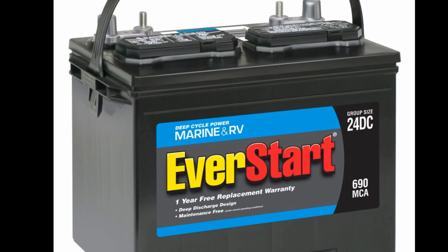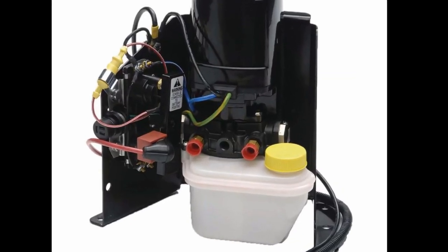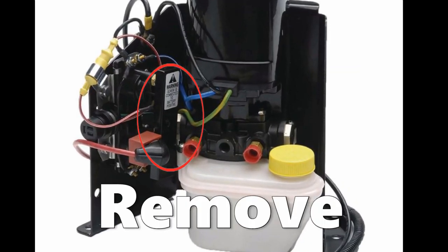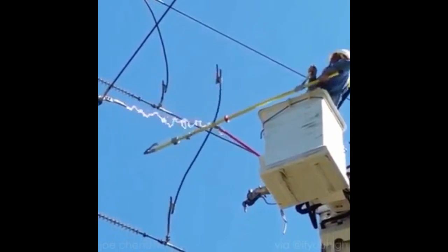Now for installing. First thing you're going to want to do is unplug the positive side of your battery, and then you're going to want to unscrew this black cover with the warning sign on it. With the cover off you can see why you'd want to unplug your battery first. All it takes is your metal wrench or socket to touch either pair of solenoid studs together to power the trim pump, and I found this out for myself — sparks did indeed fly.